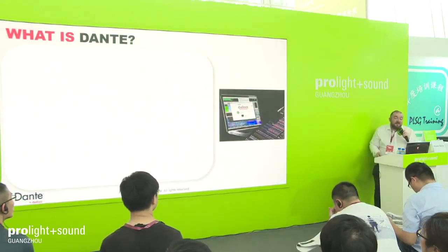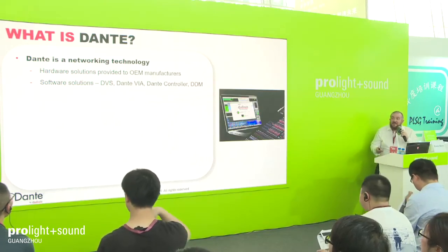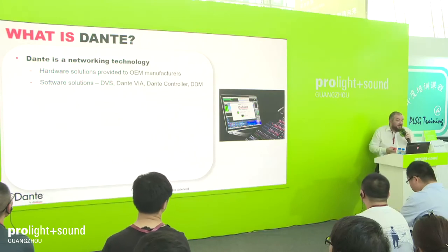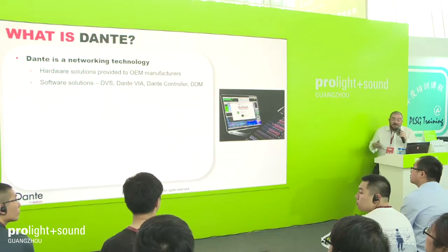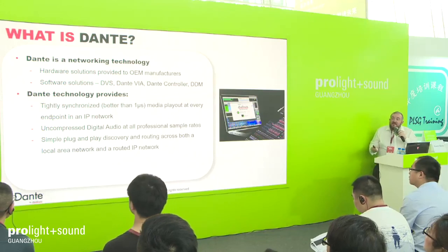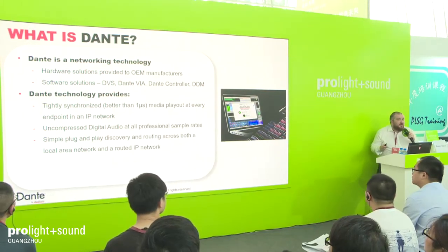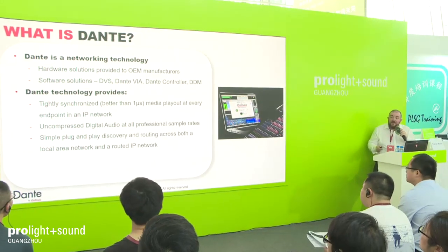So what Dante is, it's a networking technology, understandably. And it's both the technology and also the solution that's provided. So Dante is a hardware solution that we provide to equipment manufacturers. It's software solutions that we provide to end customers and equipment manufacturers alike. And what it does is we provide very tightly synchronized media playout at every point in an IP network. So that means that the timing of any audio coming out of a device will be within 1 microsecond of every other device anywhere in the network.